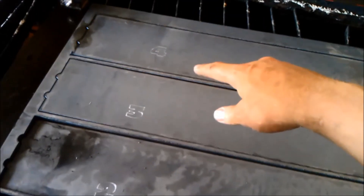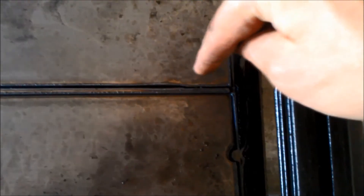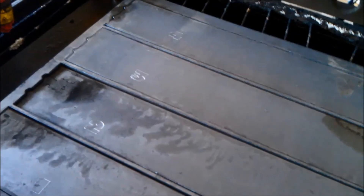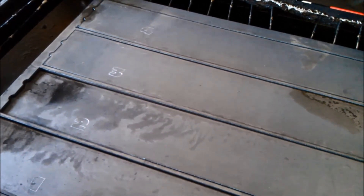Real quick — my battery is about to die on my phone — there's the plate marker marking my pieces. I cut them all out for the I-beam, just to show that I don't have problems sometimes myself. When I first started this plate, things didn't line up quite right: it pierced, went around, and for some reason went off the plate and started dragging — got a little messed up there. Everything else cut out fine except right there where I dragged a little when the tip started to move. It probably corrected itself. I should have ground the plate down before connecting my magnetic clamp — maybe it just didn't have a good ground. Apologies if you missed some video because my phone died. Here's the soon-to-be I-beam.